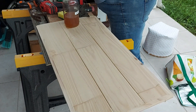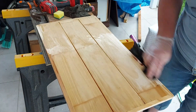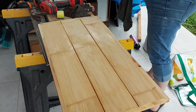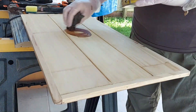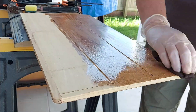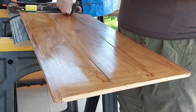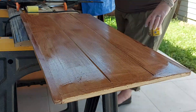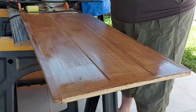Once the putty was dried and sanded back, it was time to put some wood conditioner on the tops. Wood conditioner is just a mix of varnish and mineral spirits and it just makes it much easier to put stain on. The stain I'm using is Cabot, called the colour sassafras. I totally love it - it's brown without being a yellowy brown or a reddish brown, just a full-on chocolatey brown that fits my house really nicely. I made sure to concentrate on getting it into the cracks, and then went back to put it around the edges.